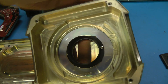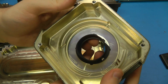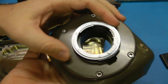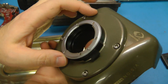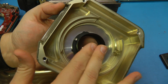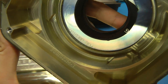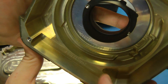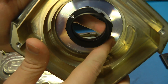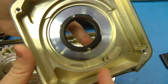On the camera front, according to the spec sheet this camera has a shutter that can come in front of the sensor to do black calibrations without having to put a cap on the lens. This one I believe has a Nikon F mount on it. It doesn't look like you could get a C mount, although I suppose one could be recessed in, since the C mount has to be much closer to the image sensor. There's also what almost looks like a thread — sort of a polygonal thread around the front — and I'm not sure what that is for; possibly for light leakage, but it definitely looks like a thread. I'm curious what that's for.